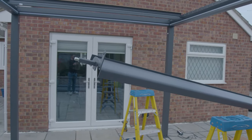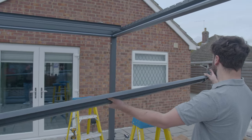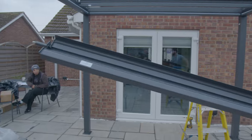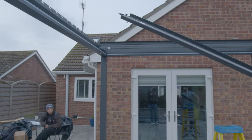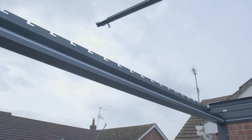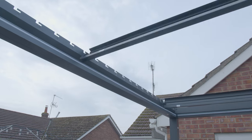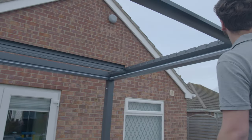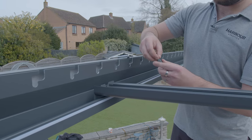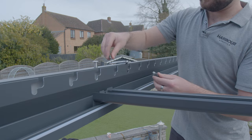It doesn't matter which end you do first. Then all you want to do is unscrew this silver piece on the end and just pop that in your pocket for now. So now with one pin installed on the end of the centre louver, you want to make sure that it's in the same orientation as the drive louver which we already installed — just make sure that these little tabs that stick up on the ends are pointing in the same direction as the one we've already installed. Now that pin on the end will fit into a corresponding hole about halfway along the pergola just up there. So I'll climb up and fit it into that slot, at which point it can sit there whilst I tighten up this side. Then we'll take the other pin for this end — just going to unscrew the silver piece, pop it on there, and the nut and washer from the other end.